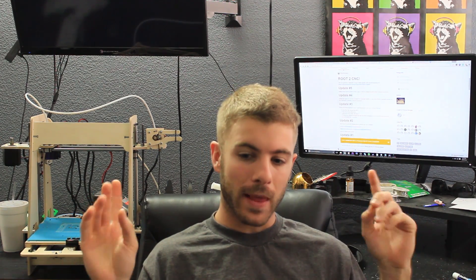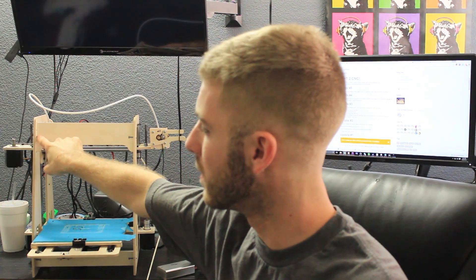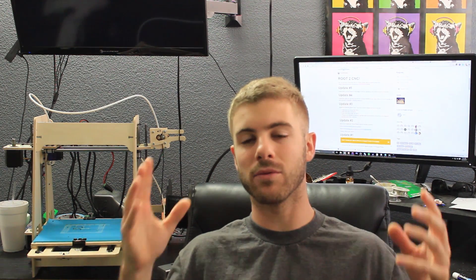One of the coolest things about this printer is that it's made out of wood — I believe it's birch, CNC-milled to exact specs. However, coming from building an aluminum kit, I didn't have to worry about over-tightening with that one. I don't want to say this kit isn't solid or secure, because it absolutely is — I can pick it up and it's not going anywhere. But when tightening the nuts and bolts, you definitely don't want to over-clamp, because it's still wood and can splinter or chip. Take your time and don't over-tighten.